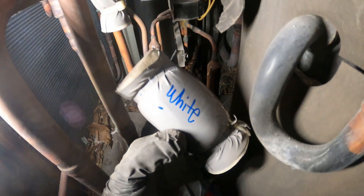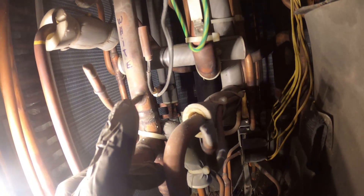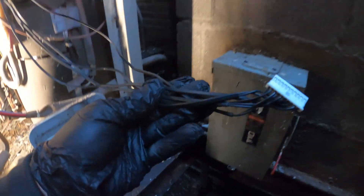That's the first thermistor right here — it's just sitting and this is a white cord. To mark things I wrote 'white' here and also on the pipe itself — I don't want to mix any of these up. My idea is to just take off the insulation and free up the thermistors. Looking at these thermistors, you've got a blue, a green, a yellow, a red, and the other one is marked with no color. We had white here, and after following the wire I can see this is not one of our thermistors — these are.